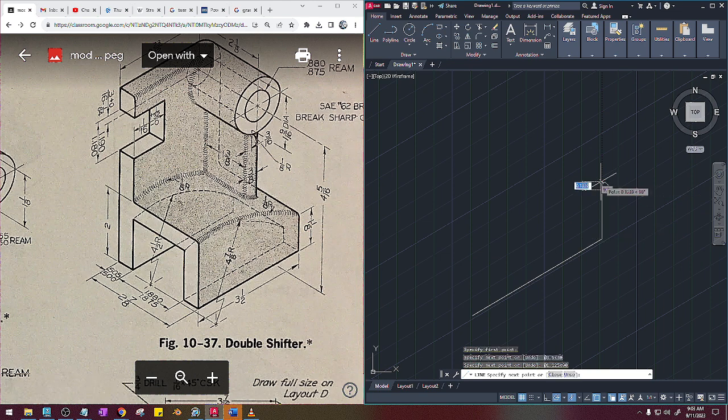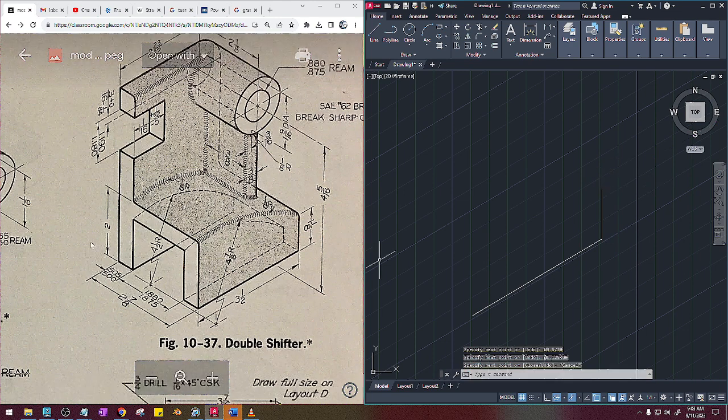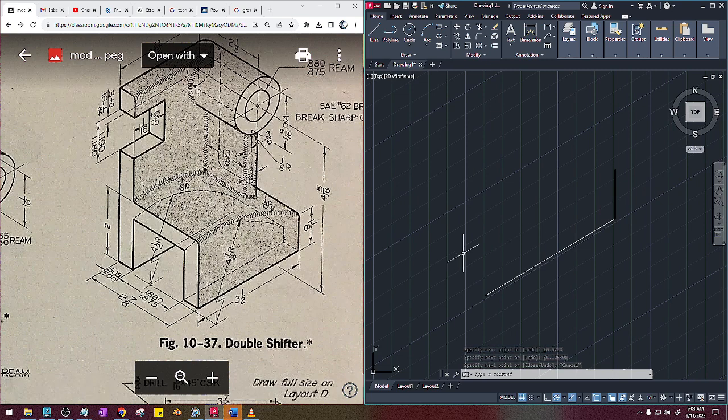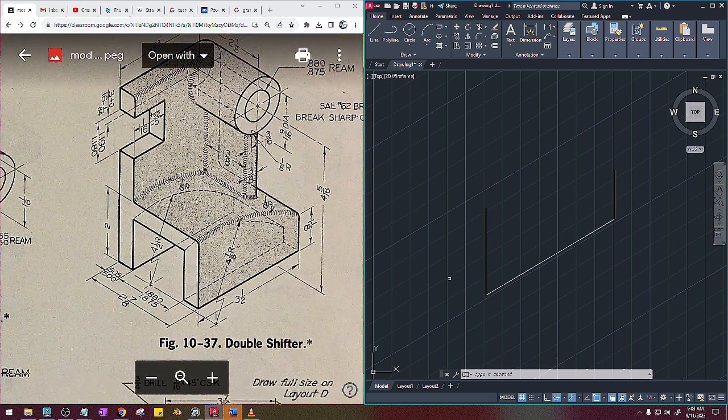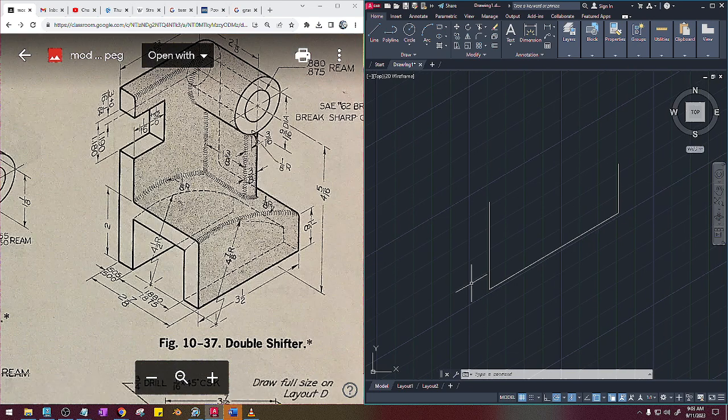I'm going to put my glasses on. Alright, so this is what we need right here, and the overall height here is, let's see, 2, so I'm going to go up 2 from this point right here. I'm really drawing lines that we need. I'm drawing the framework, but I'm also putting in guidelines. The thickness of this section right here is 0.505. But first, from this corner, we're going to go 2 7/8. And 7/8 as a decimal is 0.875. So I'm going to go 2.875 at 150.